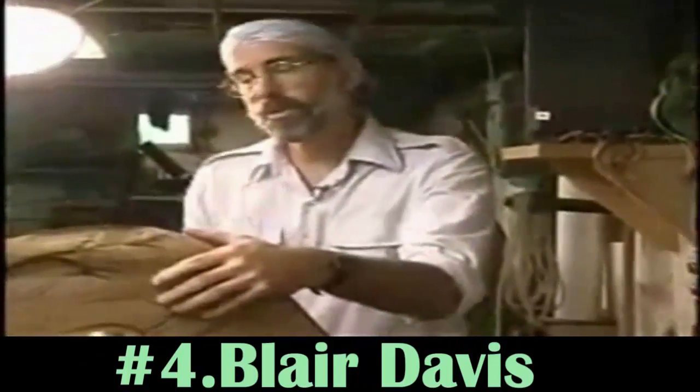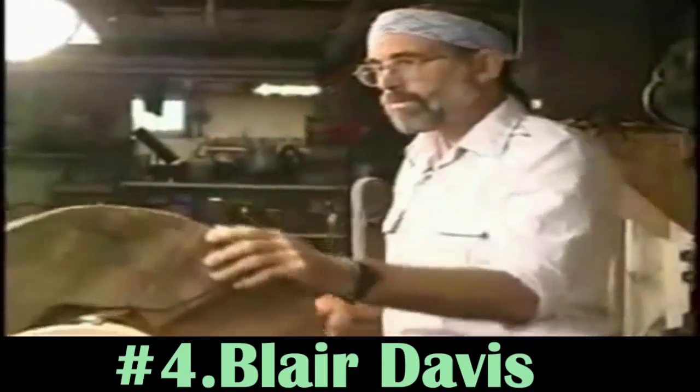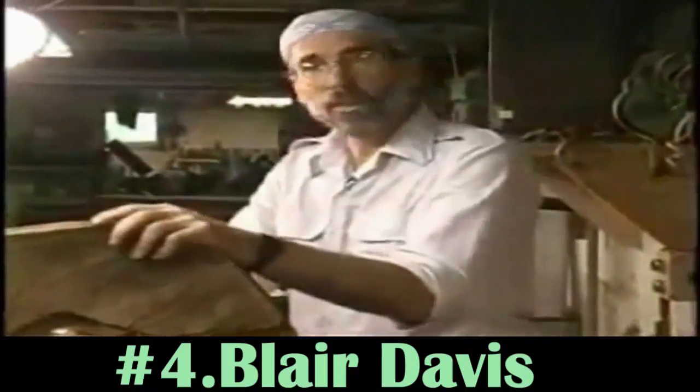There's a way to turn these where you actually turn the bowl. When you first start, if you put the faceplate on this side as opposed to the other side, then you end up with a bowl with the natural bark edge around it, which I do sometimes. And sometimes if there's an interesting little bark inclusion, I'll even leave it in the bowl.